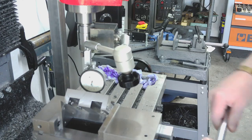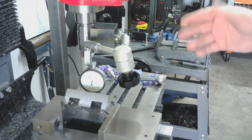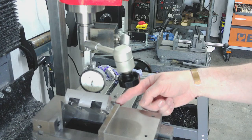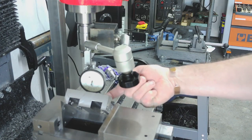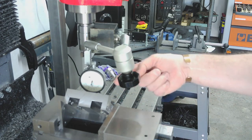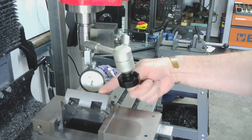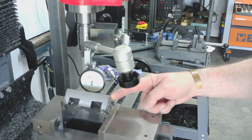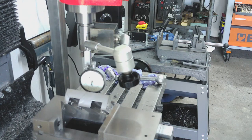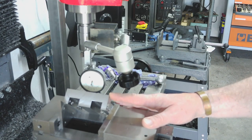Happy with the setup. I'll strip the clock off, set the cutter up, and there's another triangle to calculate. I'm going to touch off both the vertical and horizontal face with the cutter - that's why I don't need the pin - and then move up by an amount and across by an amount to get my finished dimensions for this V. As we get close to size it's going to be a balancing act measuring across the pins and over the thickness with the pin.